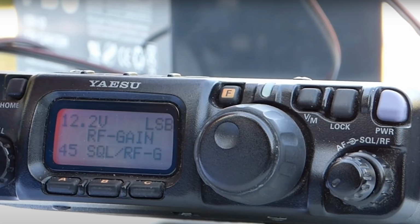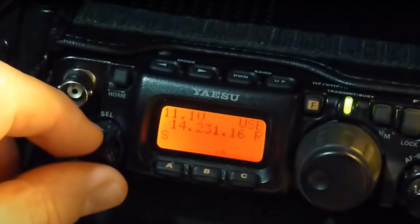But all products have their shortfalls, and this is certainly true of the 817. The receiver is noisy in comparison to more modern rigs, like the Elecraft series, that feature a very effective DSP noise reduction. Receiver selectivity can be an issue with the 817, again compared with the more modern Elecraft models. By virtue of being such a compact rig, the 817 has a very small display, which can be difficult to read for those with less than perfect eyesight.